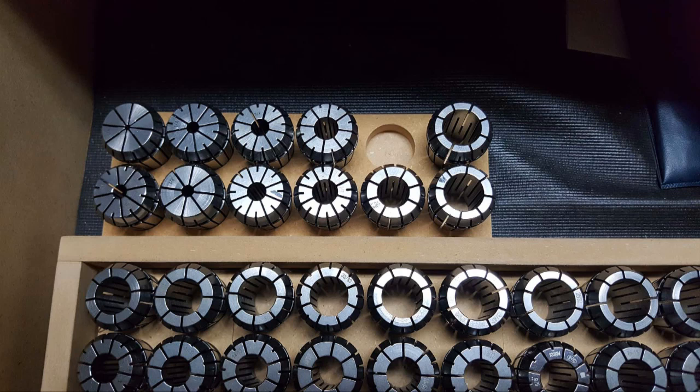When I started this hobby I just had the lathe and I got the ER32 collet chuck. I ordered a small set of collets from Little Machine Shop, then later bought all the imperial and metric. Then I ordered high-precision standard collets — quarter inch, half inch, three-eighths, and so on — so I had another set kicking around. I decided to make this little tray that holds all the extra pieces. Bottom left there is a 7mm collet — how I wound up with that extra one I have no clue.